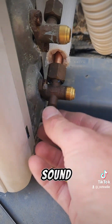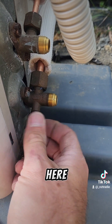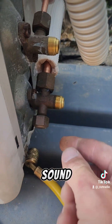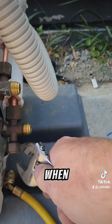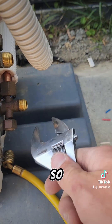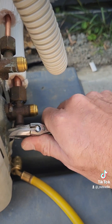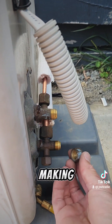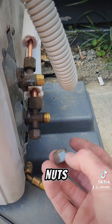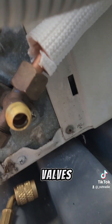I just had to investigate a bit of a sound, and I do remember when I took this nut off the back here, it was giving a bit of sound. So this nut is actually sealing in there when the heat pump's going. It's a pretty old unit, so it's not surprising that that Schrader valve is just having a little bit of trouble. It just goes to show the importance of making sure that these nuts are back on nice and tight to seal off the pressure valves and the taps on the inside.